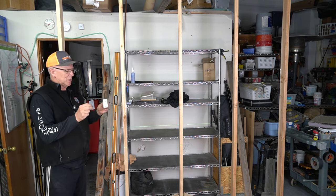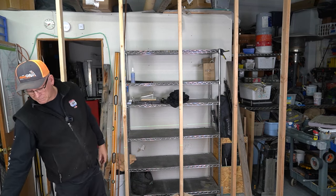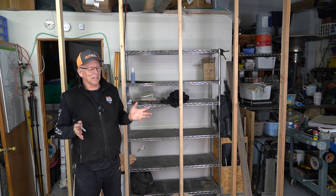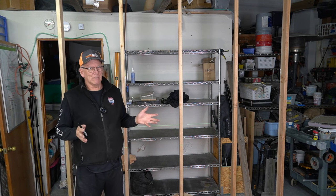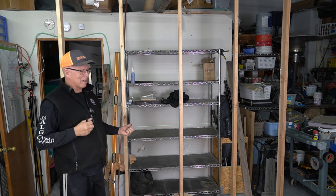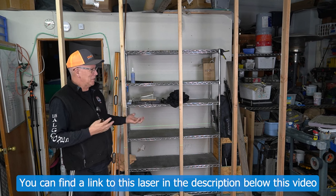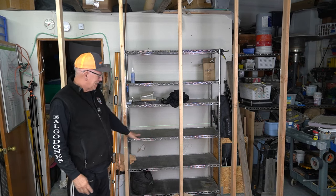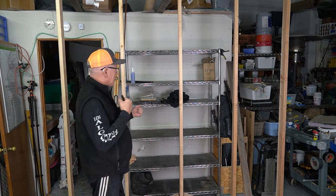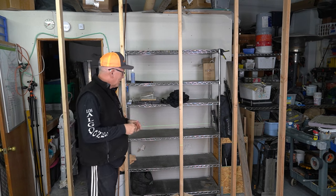I'm just going to put up two brackets. You can also use this method for setting cabinets — I've done this before. I built my own cabinets once out of melamine for my shop and they were really heavy; by the time I got done, one of them weighed 180 pounds because it was about eight feet long. I knew I was going to carry it out there by myself, put it on the wall, and get some screws in it. I did a line like this, attached a two-by-four to the wall, and managed to carry the cabinet over and set it onto the two-by-four. Once I had that done, all I had to do was hold it up while I ran some screws in. There are a lot of ways to use these.